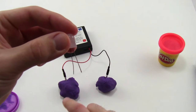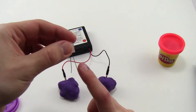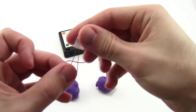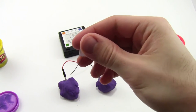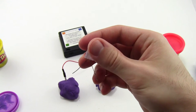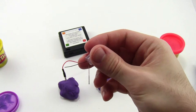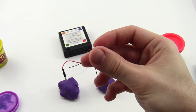The positive side of the LED needs to go to the positive side of the battery pack, which is the red wire, and the negative side needs to go to the black wire, which is the negative side of the battery pack. You can bend these leads apart slightly. This is something to watch out for if you're reusing the kit extensively — as students bend these leads back and forth over and over again, eventually they might fatigue and break. So after a while, you might need some replacement LEDs, but they should be okay at first.